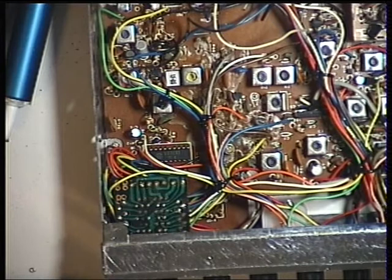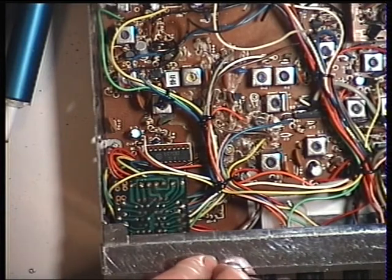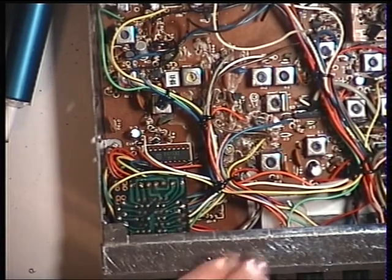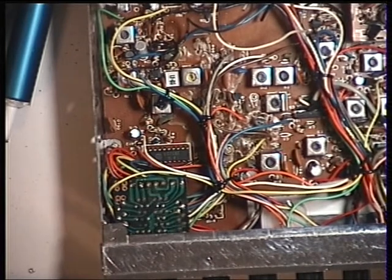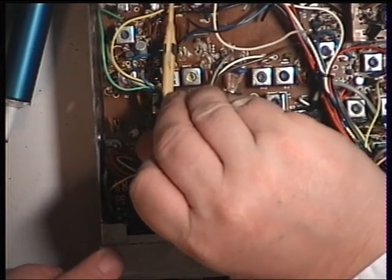And now we'll set the squelch. That's the delta tune, by the way, working. And it really does. Squelch, right. We'll turn the signal generator off. Set the threshold, switch the generator on. That's far too coarse. So let's see whether that preset at the back there is the squelch one. It is. Well, that solved all those mysteries then.